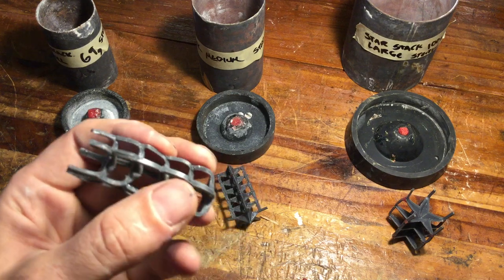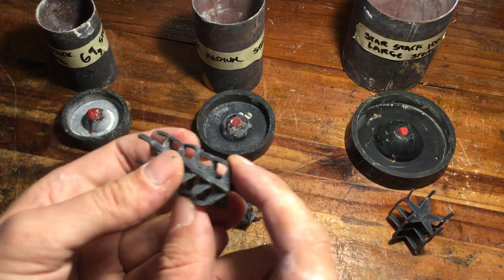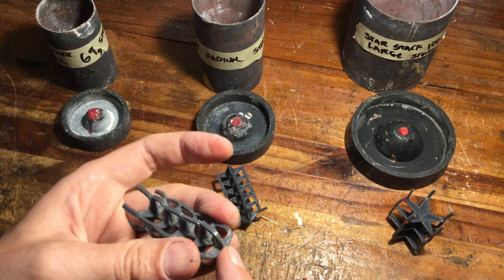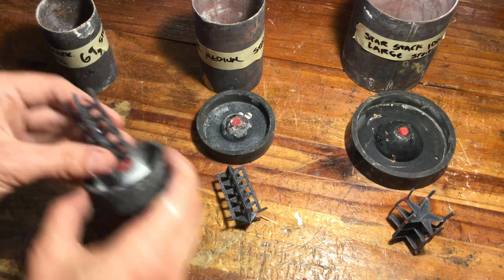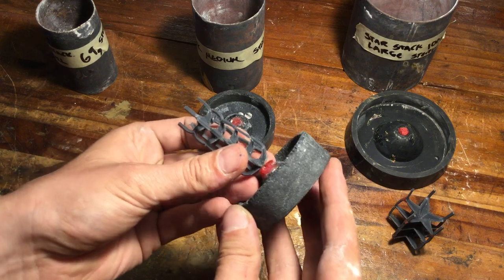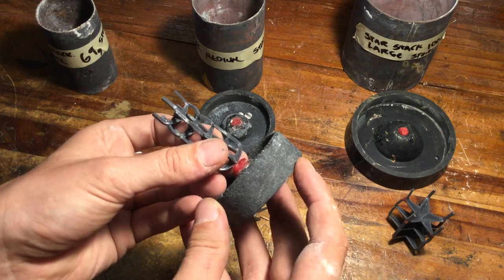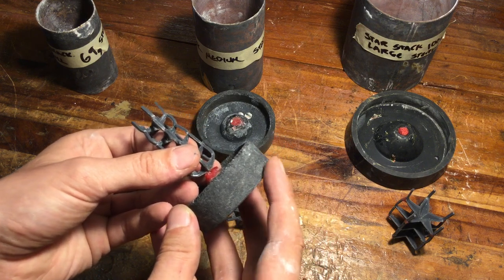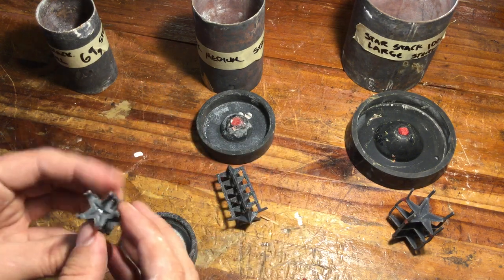As these pieces were printed, we determined what size we wanted these vents and sprue trees to be. We're putting all of our core material into the tip of this first star. Although we could just attach it to the base, the issue is that getting in there with sprue cutters, bolt cutters, or a jeweler's saw is going to be very cumbersome. So we're going to make a small choke point.